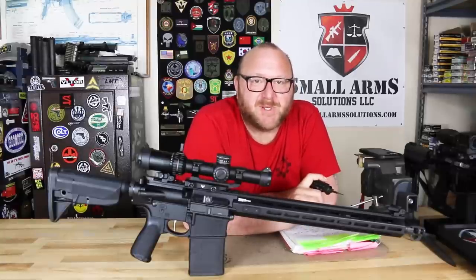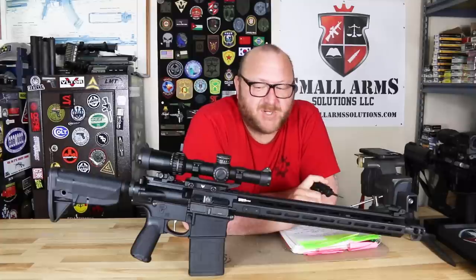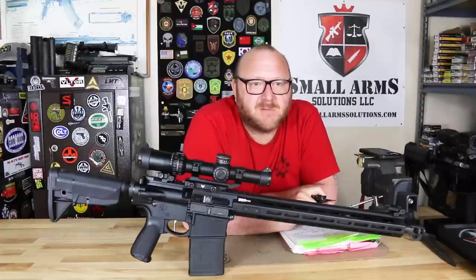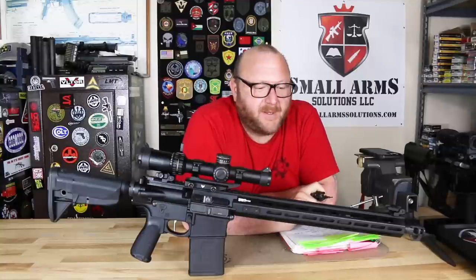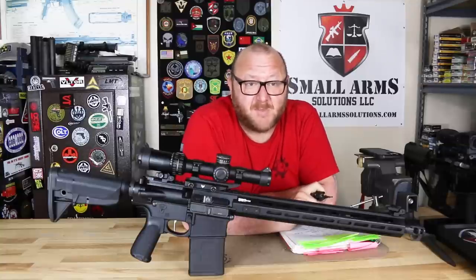Another thing that I'm very fond of on this rifle is the gas block. The gas block is drilled and pinned. And those of you who follow my channel know, to me, that is an absolutely big deal. I had one of my viewers who was having a discussion saying that drilling and pinning affects accuracy and whatnot. And you know what? I've never seen that. The most precise rifles I've ever shot had drilled and pinned gas blocks.